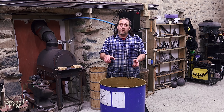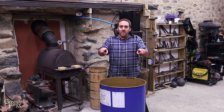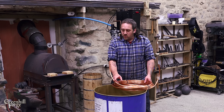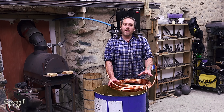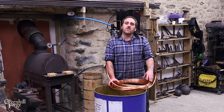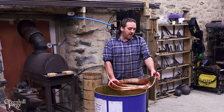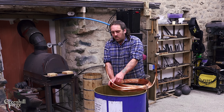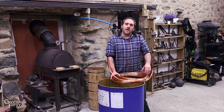Next I'm just going to put two zip ties on it to keep it in a coil, and while it's lying flat at the bottom of the barrel, I'll bend the two ends up so they can't spill any water out. Having the two tails pointing up is preventing any air from getting down into the pipe, and as I freeze it I'm going to leave the tails pointing up and leave them open so that as the water turns to ice and it expands, there's essentially a pressure relief on each end, and a bit of the water can ooze out so that I won't get a burst in the pipe. All the pressure will just come out of the ends. So now I'll go stick this in the freezer overnight, and tomorrow I can make the coil.